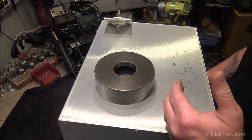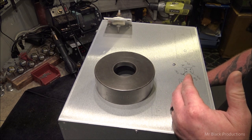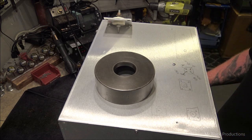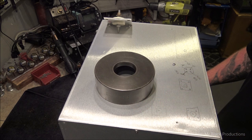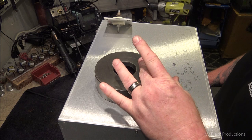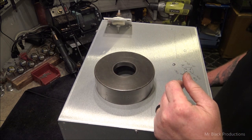That allows you to circumvent the hassle of trying to get the RF to go from the upper to the bottom portion of the deck without having any signal crossover internally with any of the other circuitry here. Usually you want to sandwich your relays, your top and your bottom relays, so that they're occupying roughly the same real estate, top and bottom on the board, so you can bolt them together. That allows you to shorten up your leads internally, which we'll cover here in just a minute.